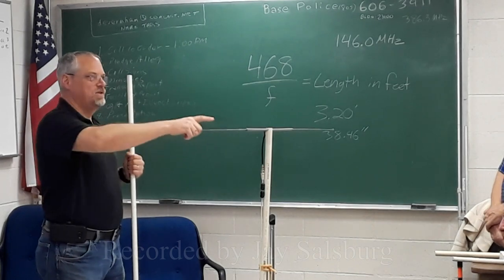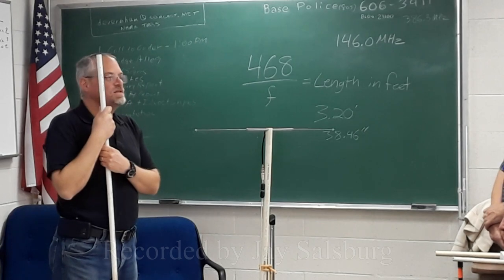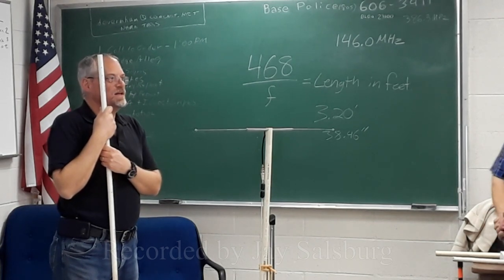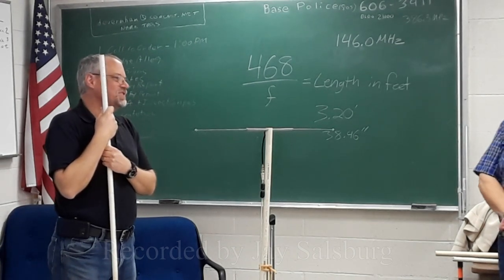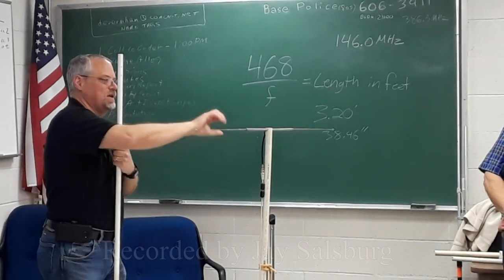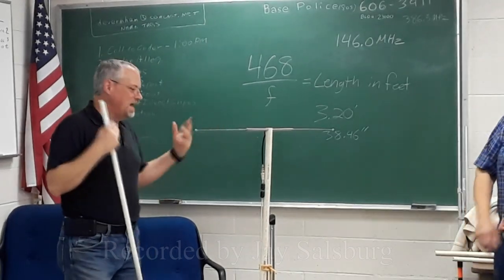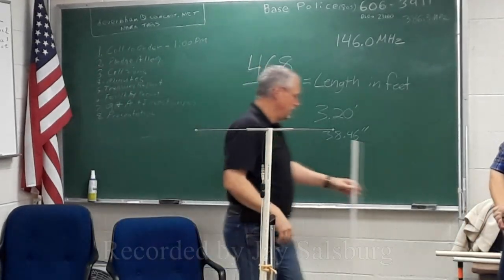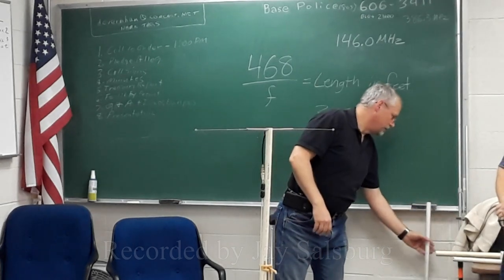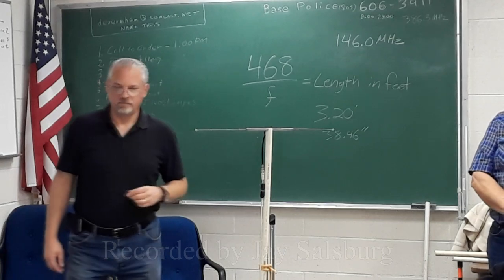It's slowing down the propagation of the signal. It's changing the phase. It bends it. It doesn't deflect it, just slows it down. It's kind of like a rubber hose, right? Everything just slows down, making it electrically longer. It's an oversimplification, but if you put it in PVC, what do you have to do? You have to shorten it, don't you? Yep. You shorten it if it's enclosed in PVC.